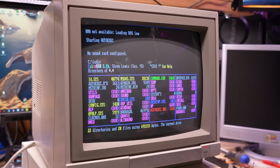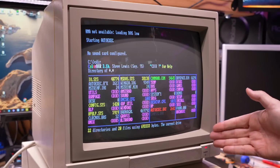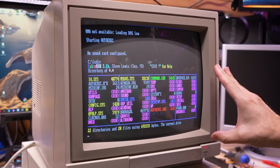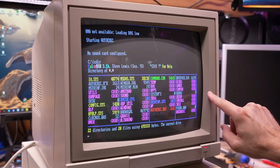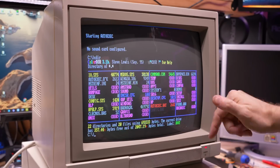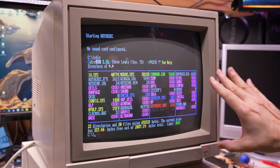I do notice that this particular card that's in here, I don't think it suffers from snow. I mean, the card, I called it a card. The CGA circuitry in here, it does flash the screen, so it turns it off during scrolling, which is that snow mitigation that is absolutely not required. If you want to know more about the whole CGA snow situation, I made a video on the second channel, which I'll link below, and I talked about the snow and how to bypass it and hardware hacking and stuff like that.